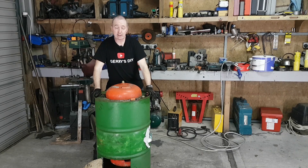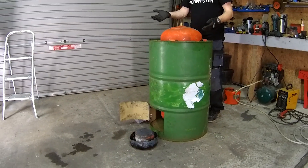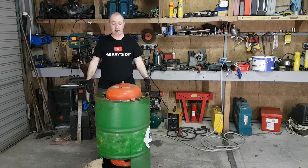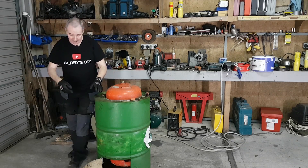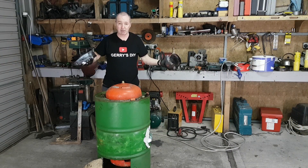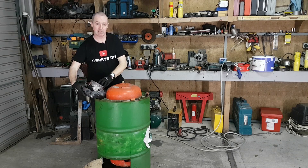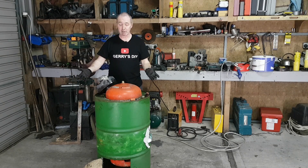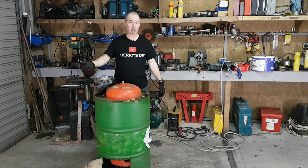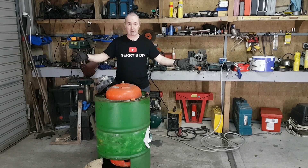This is not the most economical way to make a waste oil boiler - some way of heating hot water, making lots and lots of free hot water. There are better ways of doing it. But given that we have a propane bottle scrapped and an oil drum scrapped - maybe $5 worth of metal in the burner - given how simple this was to make, the whole assembly maybe $20, maybe less. On top of that you've got to pay for electricity, welding rods, grinding discs. But you won't go out and buy one of these things for the sort of money we can make one for. My shed heater at the moment is one of these, and it's 4 or 5 degrees Celsius outside - maybe 35 or 40 Fahrenheit - and yet here I am, I'm actually sweating.